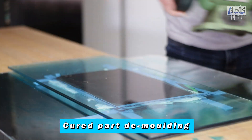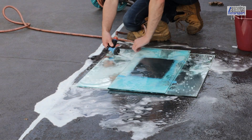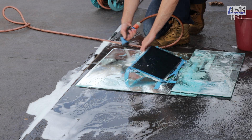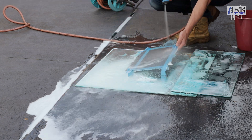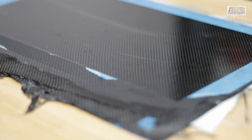Fast forward to the next day, and my brush that I was using to apply the resin is rock hard, so things should be cured. We can safely remove the part from its glass sandwich. Removing the toolbox and grinder that were keeping our carbon in place overnight, the clear glass shows an even and smooth finish — those air bubbles are indeed gone. Using the garden hose, spraying between the glass panes dissolves the PVA relatively easily, and with a little more water the part is free. The resulting surface is flat, smooth and shiny with no obvious defects. We have our blank carbon sheet from which we can cut our wheel.